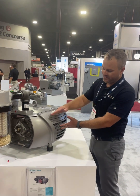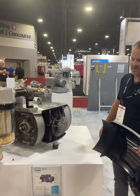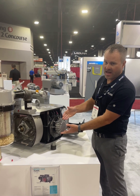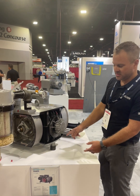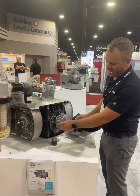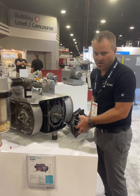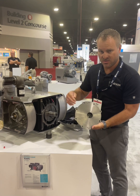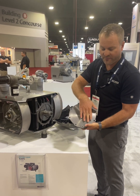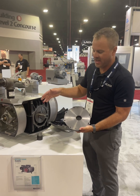On the back, there's an air guide cover with four 5-millimeter bolts that you remove. Once that cover comes off, you can see the end shield and the bearing housing. There will be a series of hex head bolts to remove. Take two of the screws from the air guide cover and insert them into the threaded holes — this will press the end shield away. Then you can inspect the B-side bearing, check for damage or if the grease needs to be reapplied, and look for any signs of contact. Black marks on here are perfectly normal — that is the vane dust.